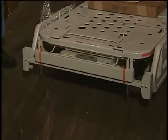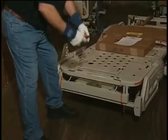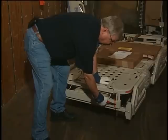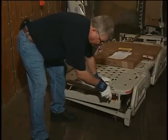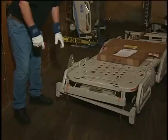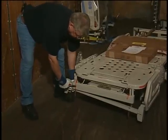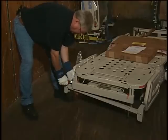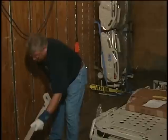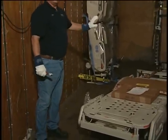Now that you have the bed lowered, take your wire cutters and come to the front of the bed. Cut the two wires on this side. You'll notice how the brace drops, so to prevent that, go ahead and pull the hook out first. Come back over to the other side of the bed, cut those two wires, and pull the pin out. The brace will now be removed. Store it on the side of the trailer. You are now ready to work on the top side of the bed.